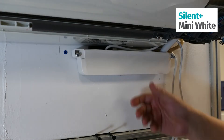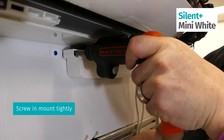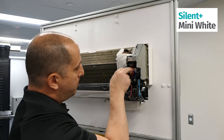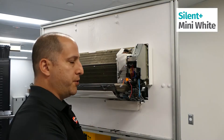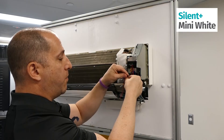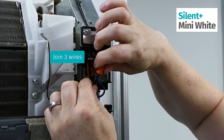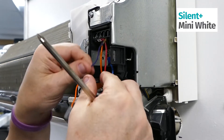The pump is fully installed here, the screws are set. Covers are off the unit, the wires are routed through inside. I pulled the front off and you'll see S1, S2, and S3 terminals. I pulled off the black wire from the outdoor unit that comes in and powers the indoor unit. What we're going to do is take that black wire, our black wire coming in, and our gray wire, and wire-nut those three together so you have three wires all together. The three wires are wire-nutted off and tucked away.